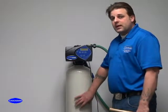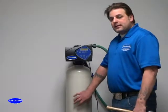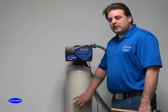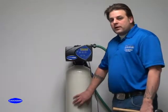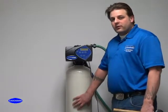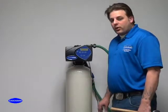It may take you some time to get these systems fully commissioned, but taking the time up front means that the media and the system will last a lot longer in the future. You can get 15, 20 years out of this system versus 2 or 3 or 4 or 5. So take your time, set the system up right, and get it fully commissioned before you walk away.